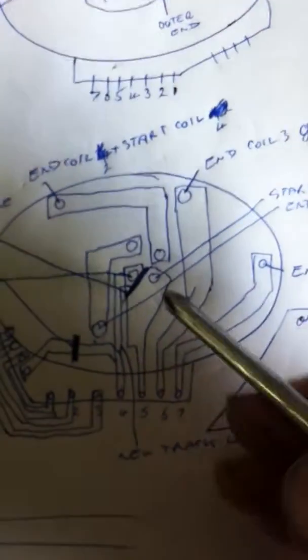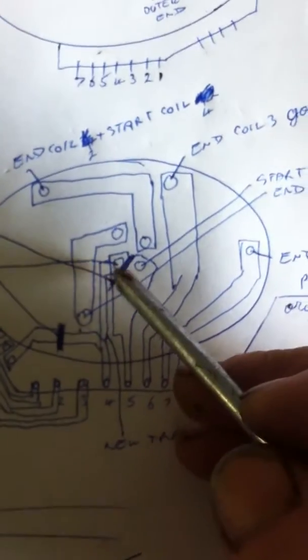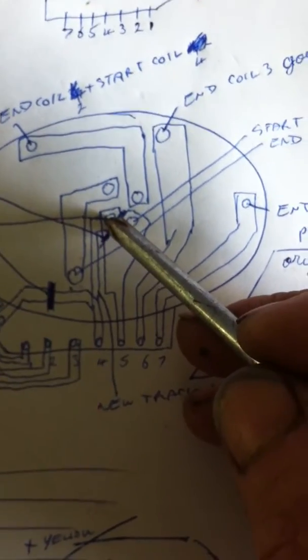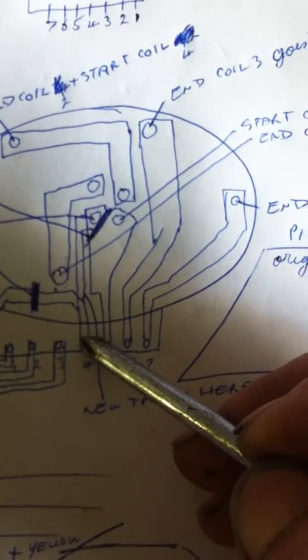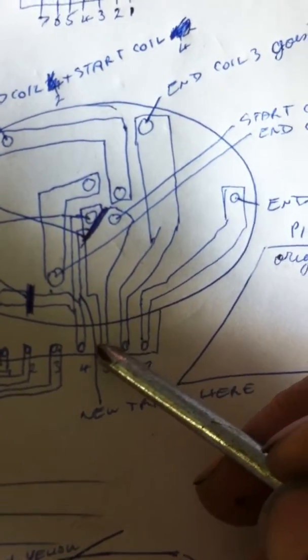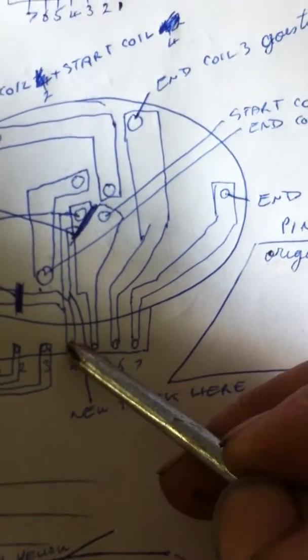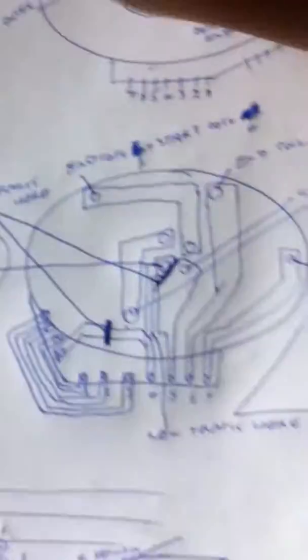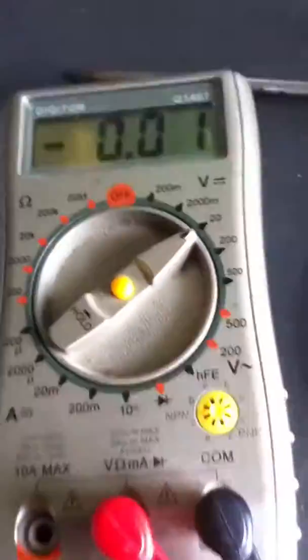The VCR motor — all you have to do is cut the track here and here, and run a wire from there down to this point, and you have the start of one coil and the end of the coil, start of another coil, end of a coil. That's how simple it is. Put it all back together, hook it up to the Bedini circuit, and off we go.